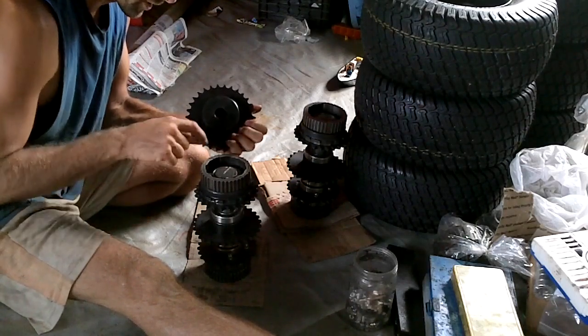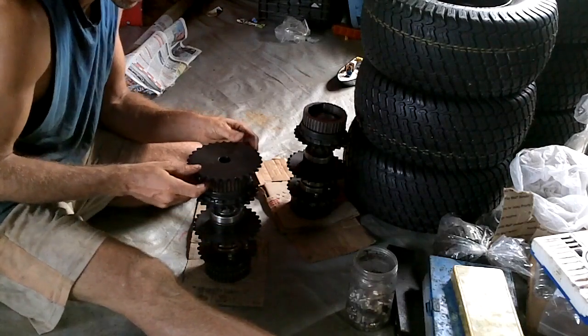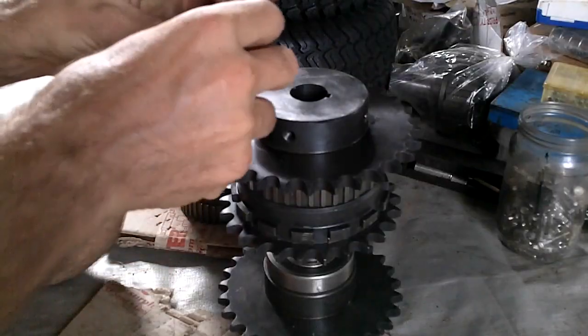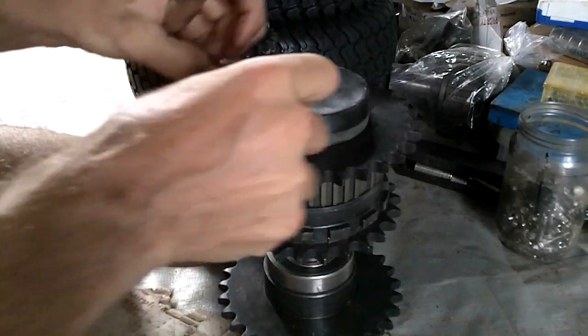I guess the trick right now is finding something that fits in here so this fits snug and centered, and then I can drill holes. Snug and centered. I need something that's like a 1 millimeter thickness, 1/16 of an inch. This is probably not the best thing for this, but maybe I can get an idea of the thickness testing one of these on here. Alright, if I get 2 of these on here, I should be able to stuff it on without it pushing them off.